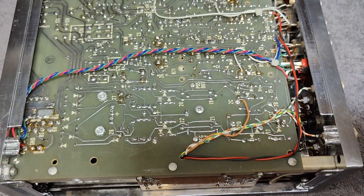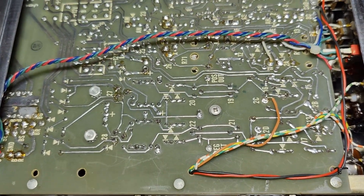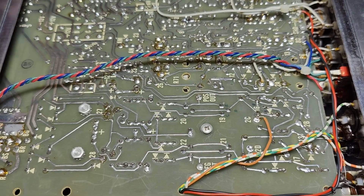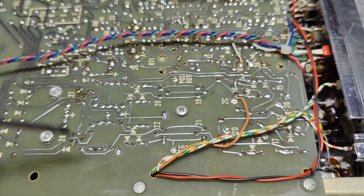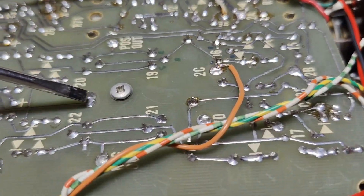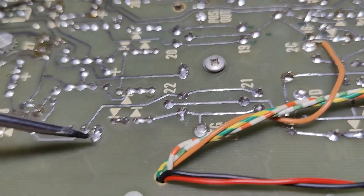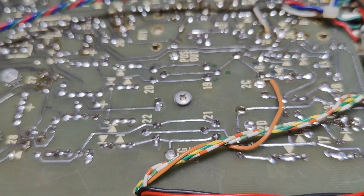The circuit board is pretty beautiful. It's a double-sided board where the top side is a ground plane covering more or less the entire area. This board is really, really old — so it's before the plated-through vias. You see those plug-in metal parts: you stick them in and then solder. So it's very reliable. There are a few of them here and there — that is how it's done.